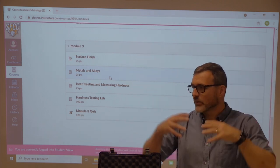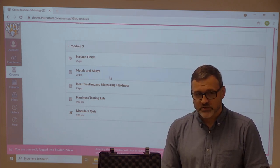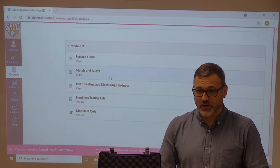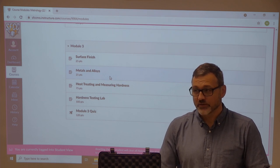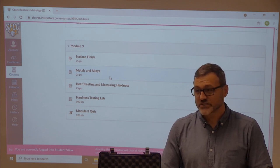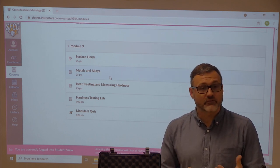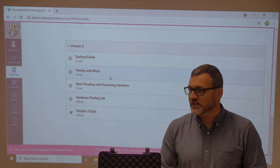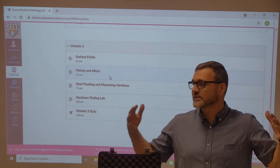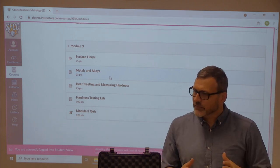Material, let's just say round parts, is typically going to grow about a thou per inch. So if you have a part that's 20 inches, you can expect to have about 20 thousandths growth on it. And that might be great for the outside, right? Because you can always turn that back off. But if your hole in the part is at 18 inches, and now it's 18 inches, 20, it's too big. So you've got to know how to leave your stock, okay? So if I'm doing a ring that's 20 inches outside, 18 inches on the inside, I might leave 50 thousandths on the inside, 10 thousandths on the outside, knowing that it's going to expand and leave me with about 25 thousandths on each side. So you've got to be able to read that material.